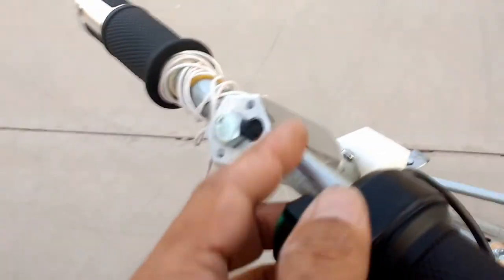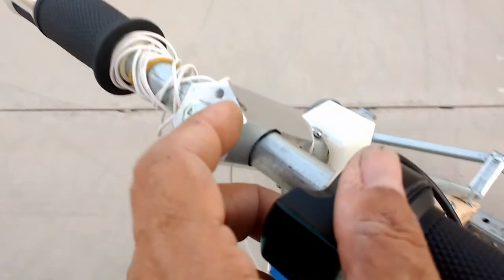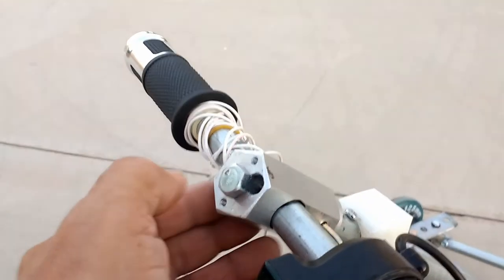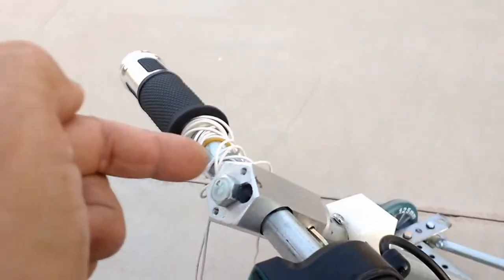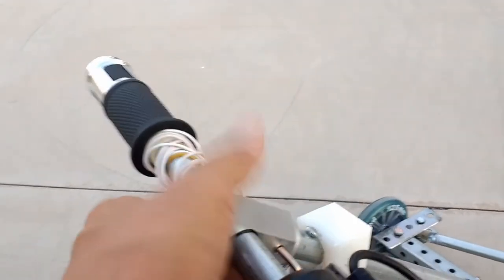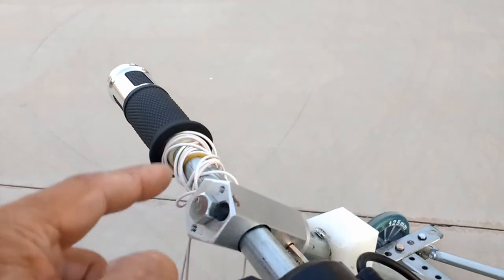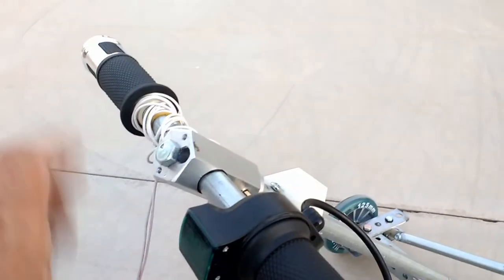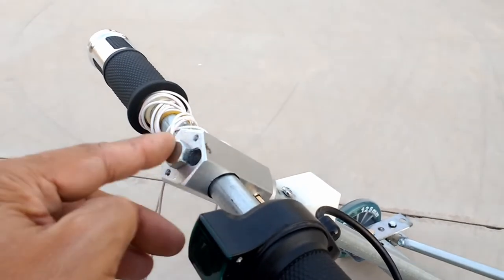And this is a piece of aluminum hex stock that I had from another project. I think this was from an injection molding machine that I originally did many, many years ago, and I decided to remove the heater plug from here. Instead of wasting this chunk of material, I re-drilled the center hole to hold this piece of conduit that I'm using as my steering mechanism here.